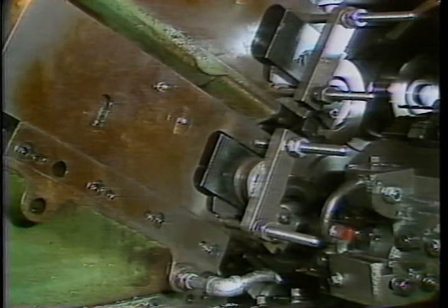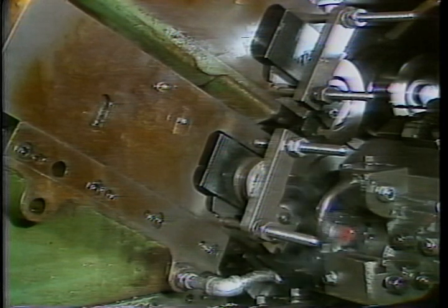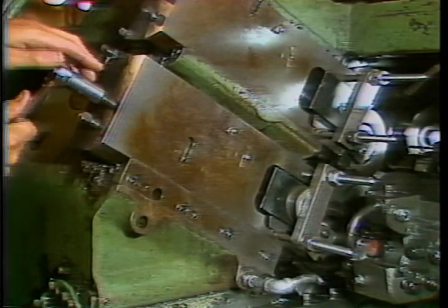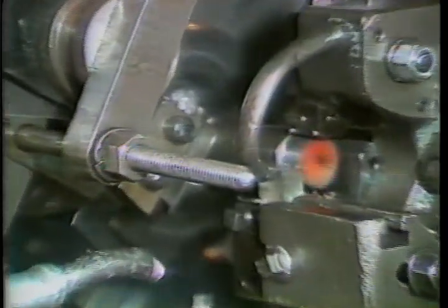Start the machine and stop it when it reaches high point. With the spindles turning and the feed disengaged, advance the tool into the work until you cut a part which is ten to fifteen thousandths of an inch under the required size of the part.